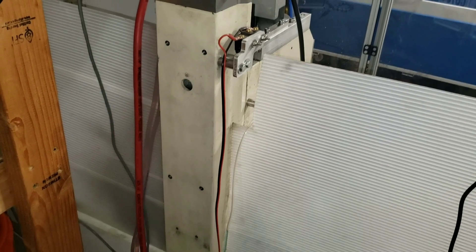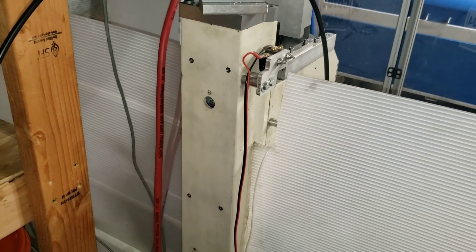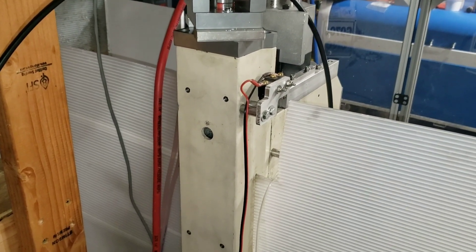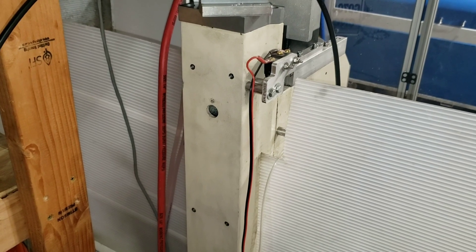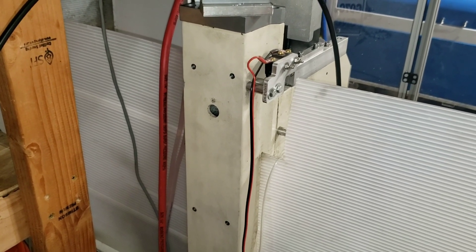I was really careful and was able to drill and tap this thing in place. Drilled out, tapped really easily, got the six holes in. Now I'm going to set up an indicator on the front of the head and make sure that when I torque this column brace down the indicator doesn't move.